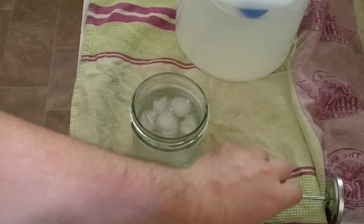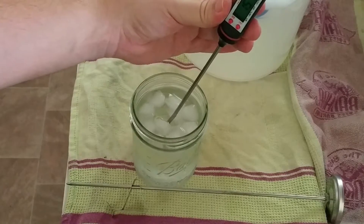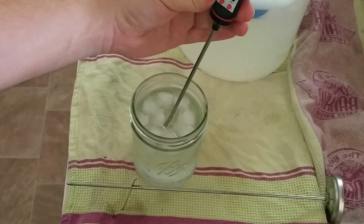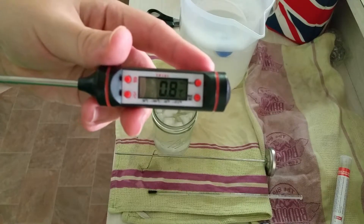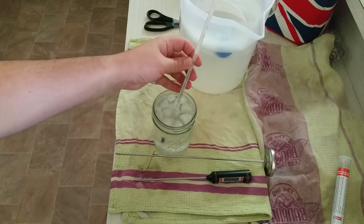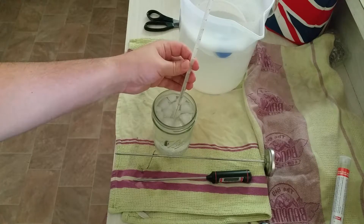So I'll put this one in now - it's been about two minutes. Let's give it a bit of a stir just to make sure it's all mixed. This should read, once it stabilizes, hopefully zero degrees or anywhere between negative one and positive one. That one's stabilized - as you can see we've got 0.8, which is within the allowed range, so I'm happy with that. I'll check the glass one now - this one has a line we need to insert it to. We'll wait for it to stabilize and it should read between negative one and positive one degree.